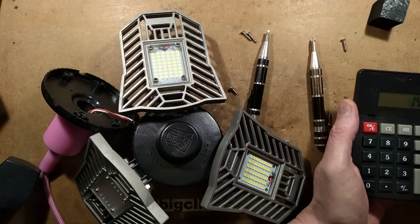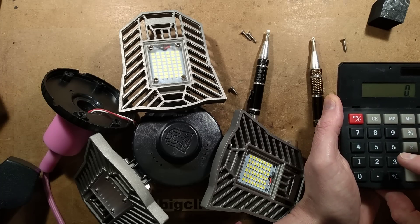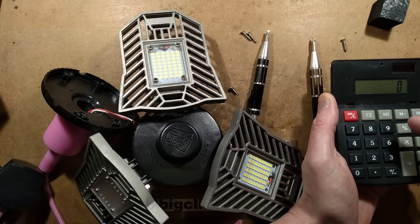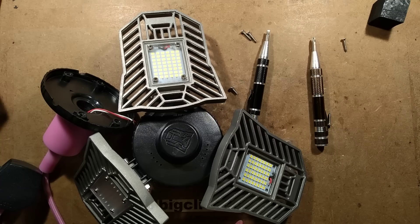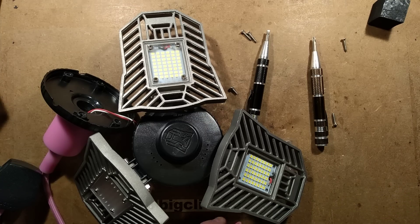Each LED is passing around a third of a watt — about 100 milliamps per LED — so 200 milliamps going through the parallel pairs. The power of each section was roughly about 18 watts. 18 watts divided by 48 LEDs equals about a third of a watt per LED, so about 100 milliamps per LED. I'm going to do these tests and then I'll leave the results down below in the description.